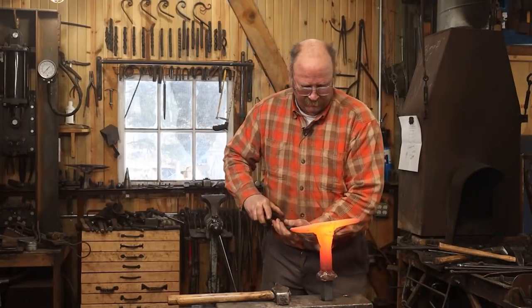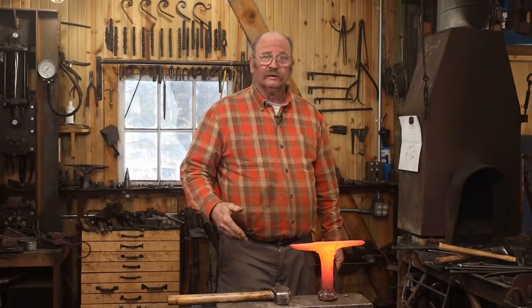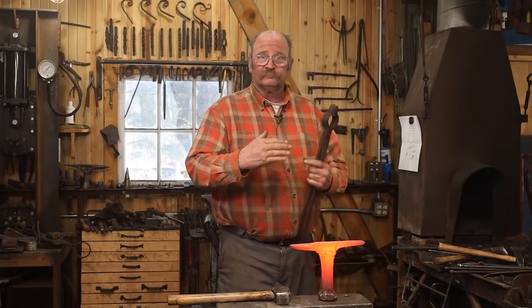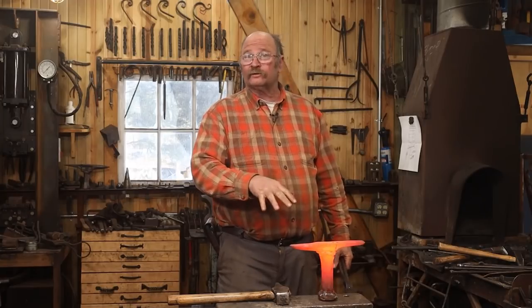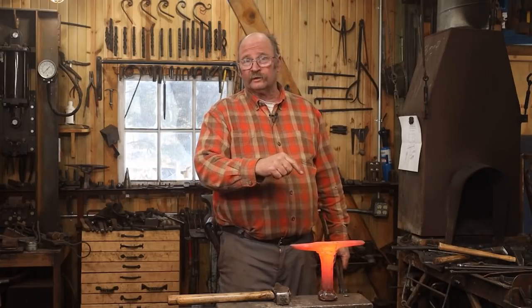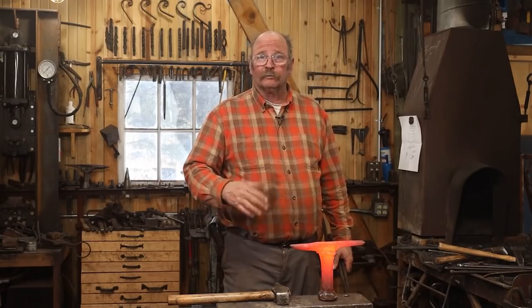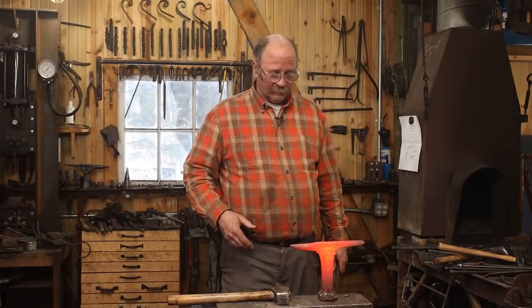It's been a lot of welding and chipping and a little grinding and some wire brushing and a little bit of straightening. I had to bring it back up to heat and forge it to straighten some warpage and some misalignments. But I think it's coming out pretty well. The weld is definitely proud of what I want in the long run, so I've got something I can grind down, make it all flush, and hopefully there's no voids or porosities in the weld.